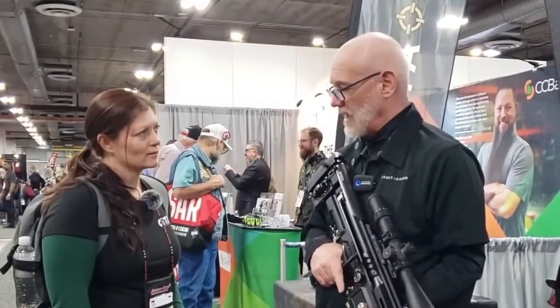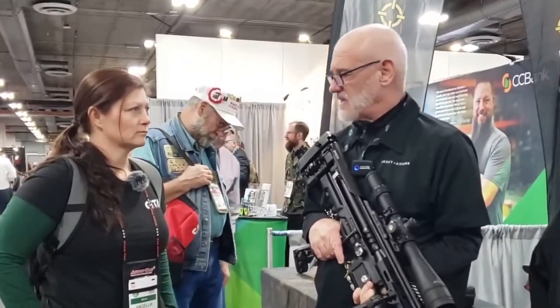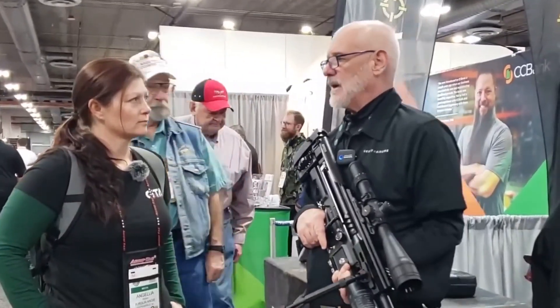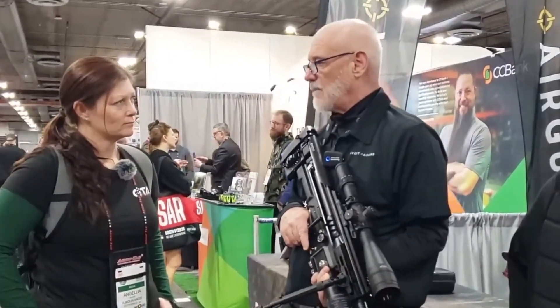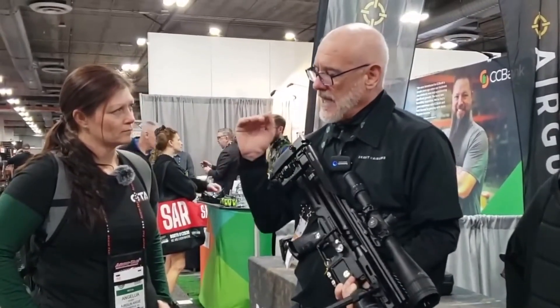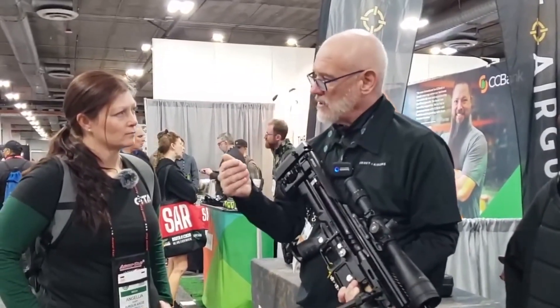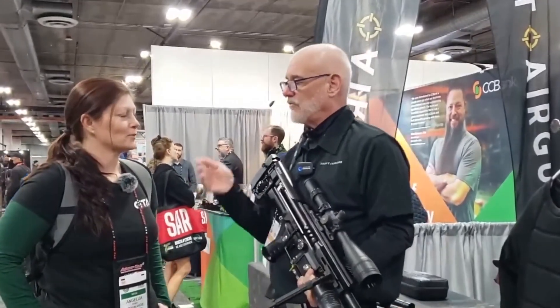Other features you might appreciate: if a gun sits for 15 to 30 minutes, there's what we call stiction — basically the O-rings take a set, and the first shot tends to be a little different than following shots. So we give you a programming capability called First Shot Draw. It gives you a time you set, and on that first shot it adds four milliseconds of dwell, or additional push to the solenoid, so you can overcome that friction and count on your first shot.